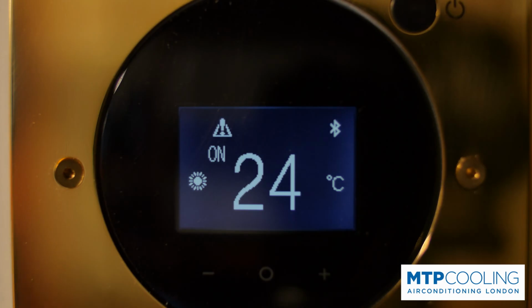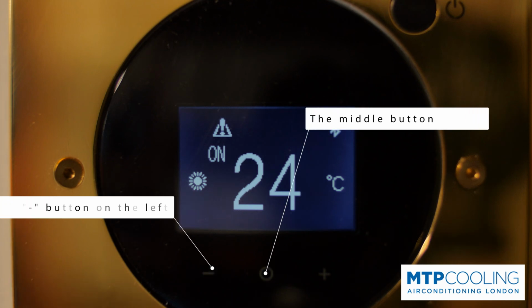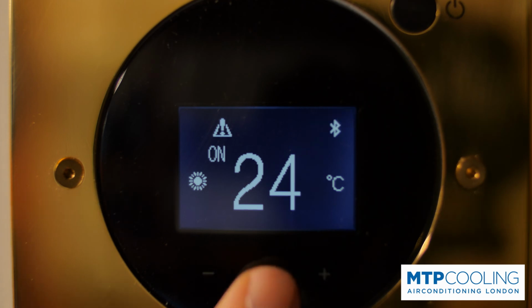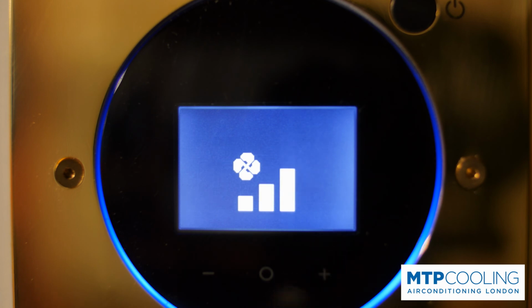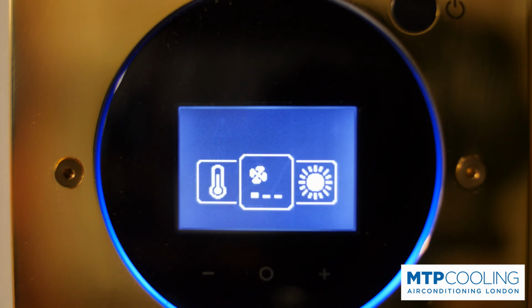To use Madoka controller, there are 3 buttons. You've got the middle button, and you've got one on the left, which is minus, and one on the right, which is plus. The middle button allows you to go to the menu, and you will be able to select the following. The first is the fan speed. So once you select the appropriate fan speed using plus or minus button, you then just click the middle button to confirm it.